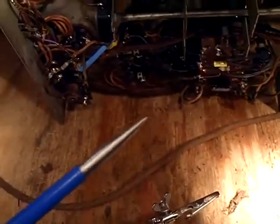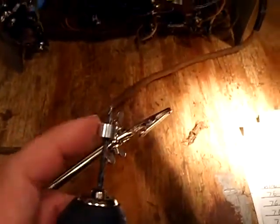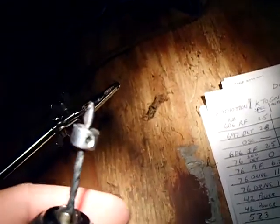Here's a pretty good tip for drilling holes in the speaker: first, use a center punch to mark the hole — everyone probably knows that — but here's a neat trick. Go to the hardware store like Ace and get a little sleeve that tightens with an allen wrench. Put the sleeve over the drill bit and tighten it in place. Now when you drill, the bit won't go all the way through and hit the cone — it'll just stop right where that sleeve is. That worked really well. The guy at Ace suggested it and I thought it was a great idea.